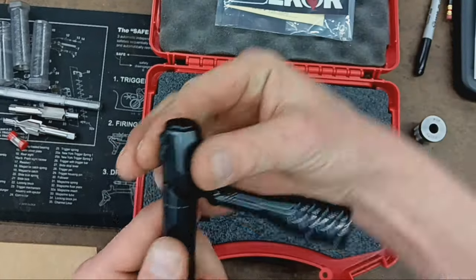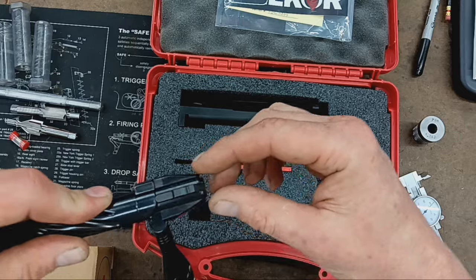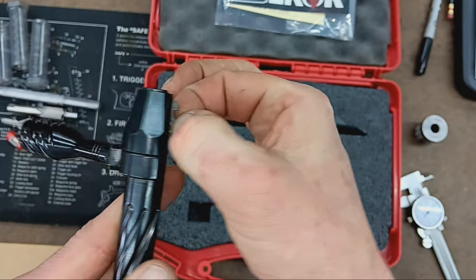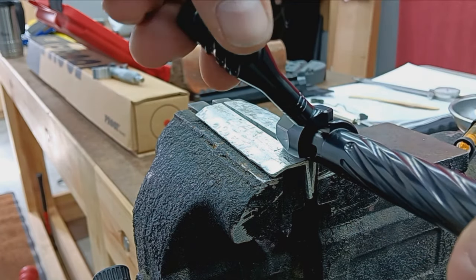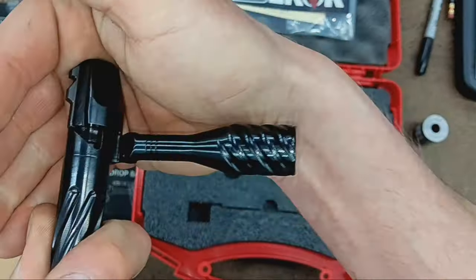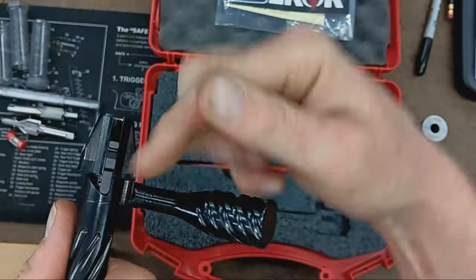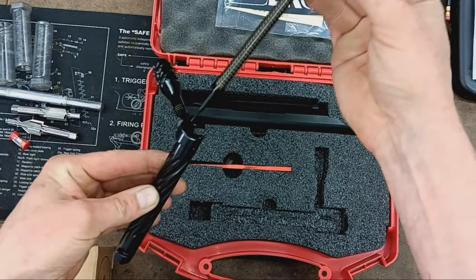And then the firing pin assembly back here is going to be your typical threaded-in style. But I can't use my Obendorf tool because of the design of this shroud. It's a little bit fat and just too stubby to get that around. So what you do is put padded jaws in your vise, grab the cocking piece here, pull that rearward, and then unscrew it, because the spring pressure as you unscrew this is going to make it go down into its fired position in the bolt, like that. And no one has enough strength to push that over. So you just have to pull that cocking piece back to clear this area, and then it will unscrew. Okay, so once you get that removed, the whole assembly just comes right on out.